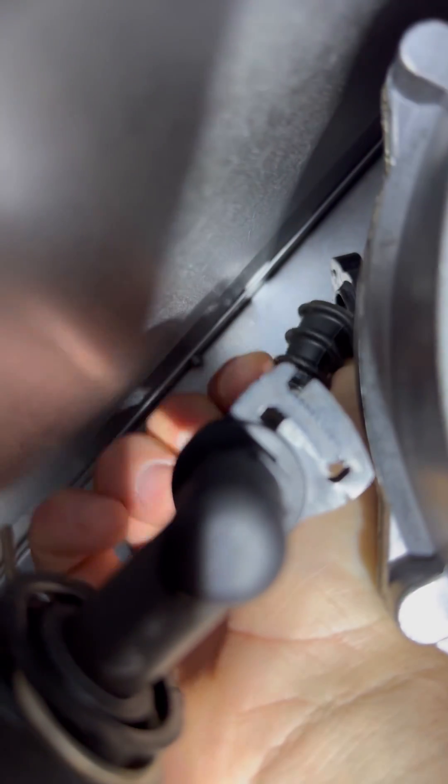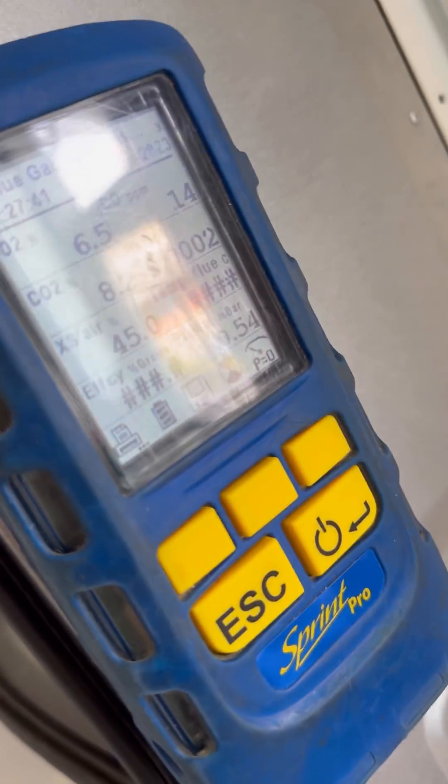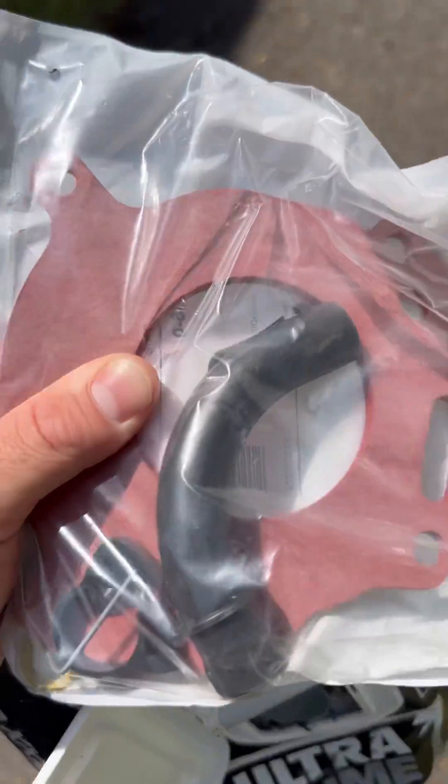You can see here this one's really bad — it's literally come away at the top. Because this is a gas supply tube, you're not getting enough gas into the chamber and you're also pulling in a lot of air, which is why you can't achieve the right readings.